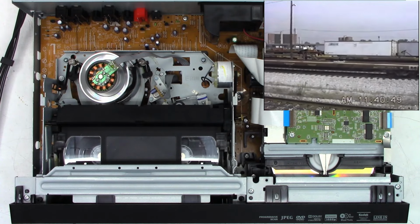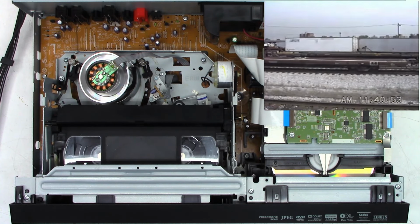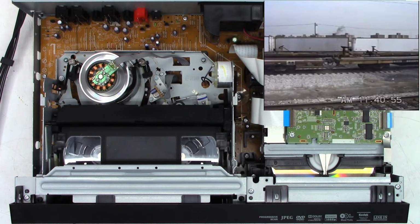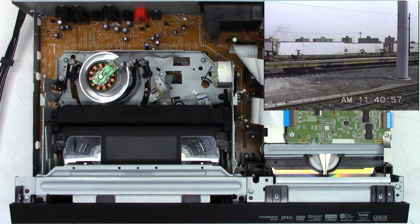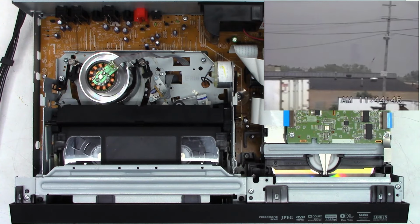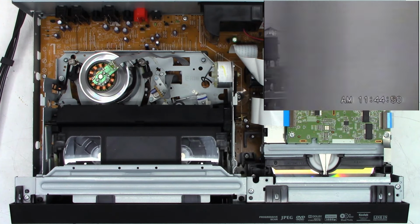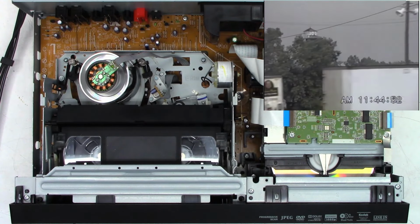The flickering is, I used my Sony EVS 3000 high 8 VCR to copy it over to VHS, and it has bad caps in the time-based corrector. I never did correct bad caps in the time-based corrector, so that's why it has that flicker to it.